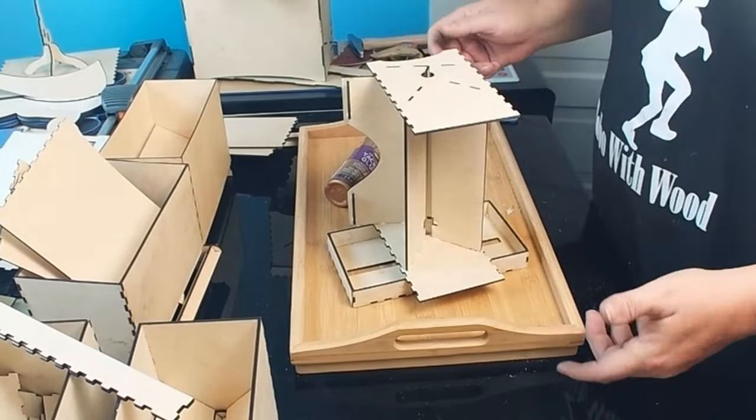So go ahead and do just like we did before. I'm gonna put glue on all of the flat tabs. Once I get this glued up, it'll help keep this square. Now I'm gonna go back and put it in the slots. And I'm doing this because this is completely dry. It has no glue on it. So by getting glue here on both surfaces, it's gonna glue up nice. And I can always clean up the squeeze out.